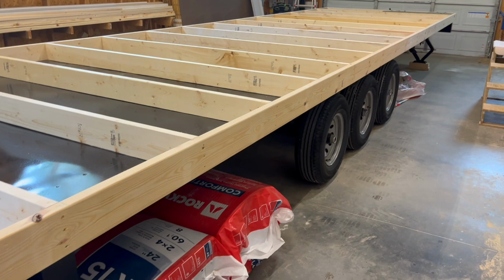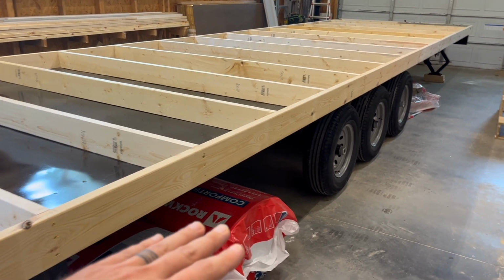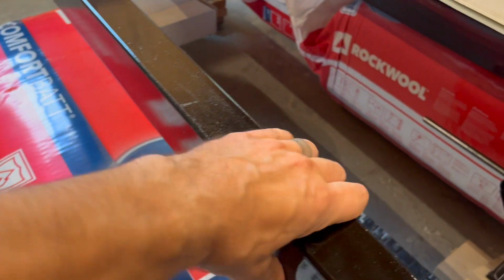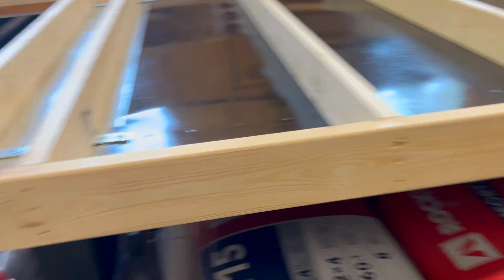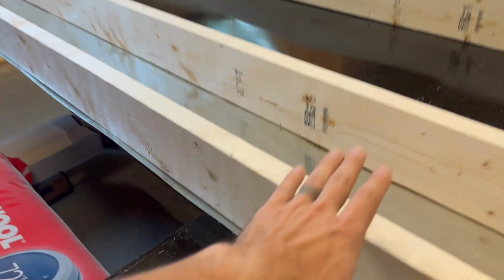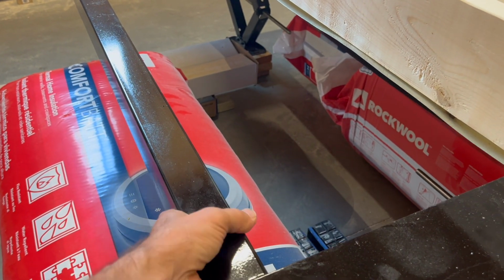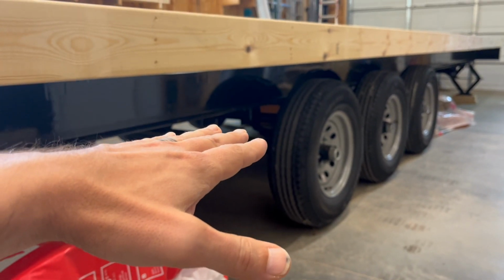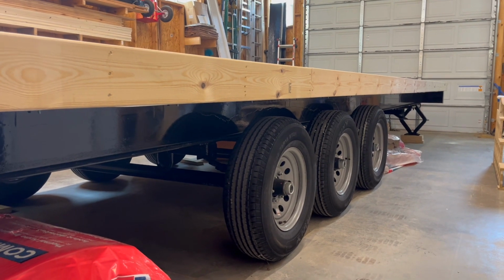If you can imagine, we have built these kinds in the past, where the structure of the trailer is dropped down and intersects with the wheels, and you build a wheel well around that. That's usually built out of something like these cross members, which is tube steel. And then there's usually a bigger tube steel that comes all the way out. That steel is used as the actual floor structure. So instead of building wood joists on top, you would put subfloor right on top of the tube steel, insulate in between, and the skin would go underneath. And you gain an extra 8 or so inches, which can be important if you are planning a tiny home that depends on a loft for space.